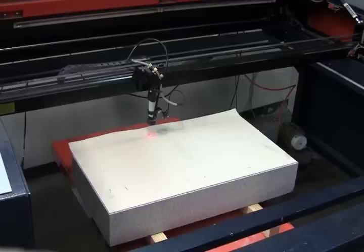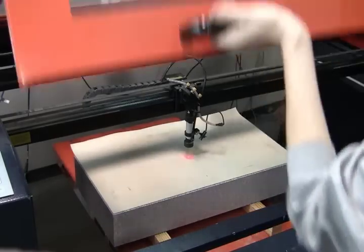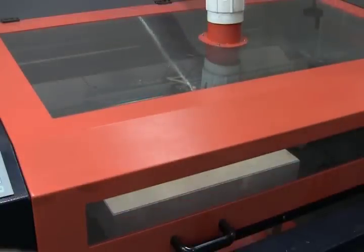As I've removed the outside edges and borders of my layout, I'll want to set my LaserOrigin to Center for the best results in ensuring my cut will match the stone properly. From here, I'll go through the Download menu as usual, using Delete All to clear out any existing files, and then Download Current to bring in our stencil layout and parameters. I would also highly recommend that for lasering stencil you use the cone attachment for your laser nozzle, to ensure we'll be able to block off more of the soot that will be kicking up, preventing the lens from becoming dirty and losing power over time. Once my stone is straightened out and leveled under the machine, and I have my laser arm over the center, I can press Start on my machine to begin my cut.